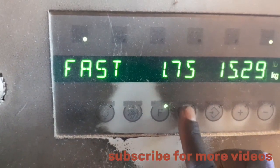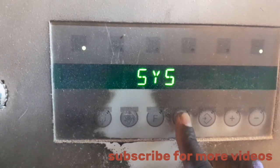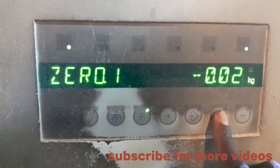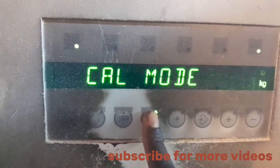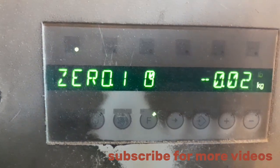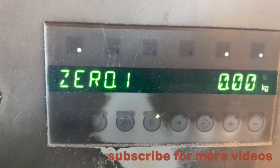From there, you push the parameters to parameter ATC and change it to ADC — that's where the scale calibration and zeroing can be carried out. You take it to zero. This must be done after cleaning of the scale. You click the F button and you see it clocking — at this point the scale is being captured at zero.